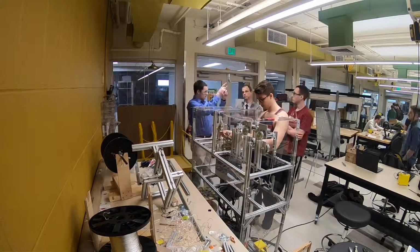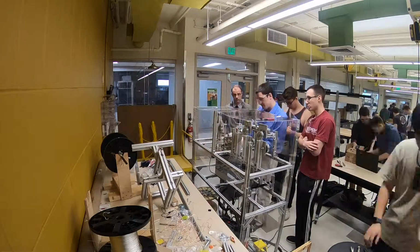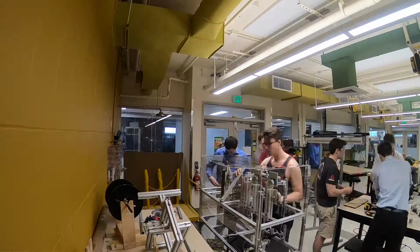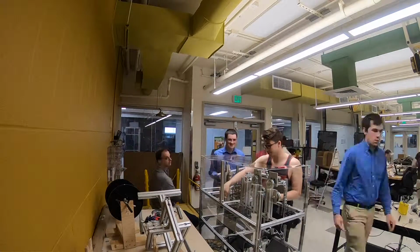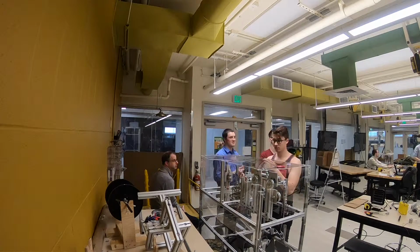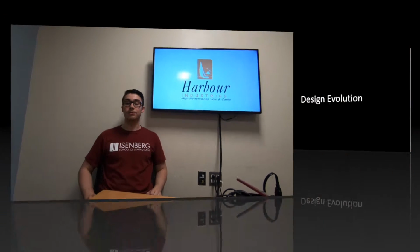Our client has a number of requirements for this project to be successful. First, it must be safe and have no pinch points, along with sufficient guarding to protect the operators. It must be ergonomic and user-friendly, while also being compact, fitting in the limited space available in the production line. Further, it has to operate at a speed greater than 125 feet per minute and be able to join a variety of wire gauges from 14 all the way up above 22 gauge wire. It should be precise, able to repeatedly make the wire tie-in, while also avoiding contact with the wire until the insulation runs out and it's time to make the join.